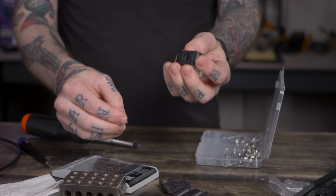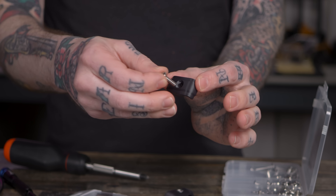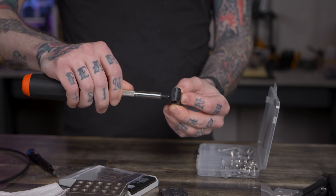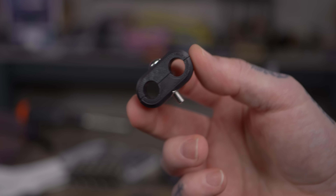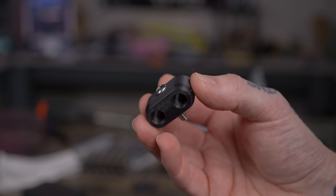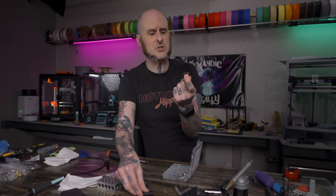Here's a quick demo of how the clamps assemble: you put a 10-32 hex nut into the backside and a 10-32 screw through the front side, which sandwiches the two halves together. When you tighten it down, you can use a longer screw and drill and tap into a frame rail, or use a nut-sert to attach directly to components. These parts are available for download on my thanks page — there's a link in the description. I've made similar ones for water cooling my computer. You'll find the link in the description.